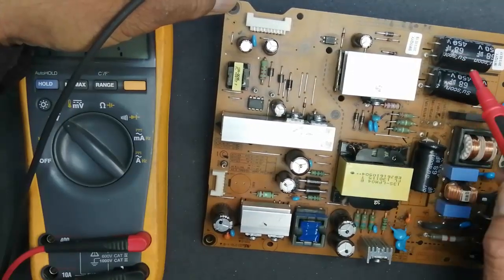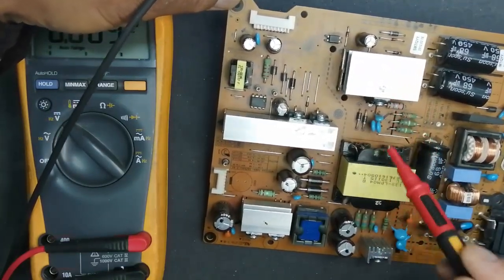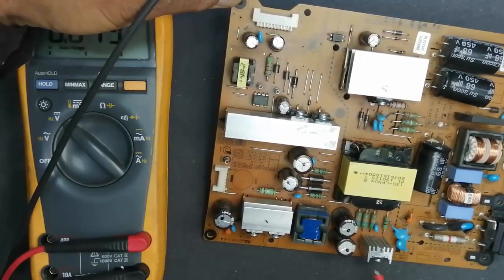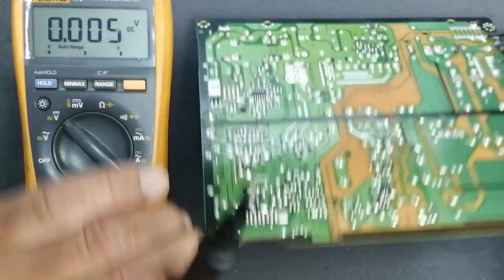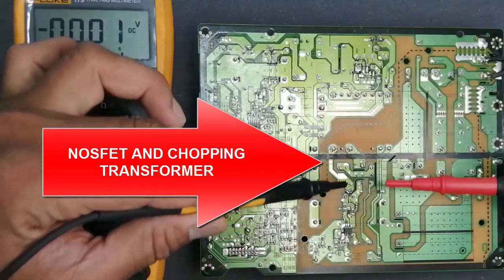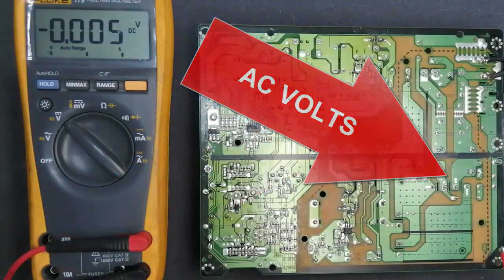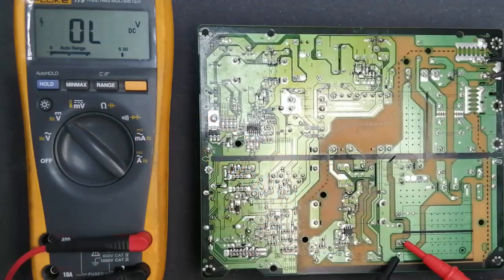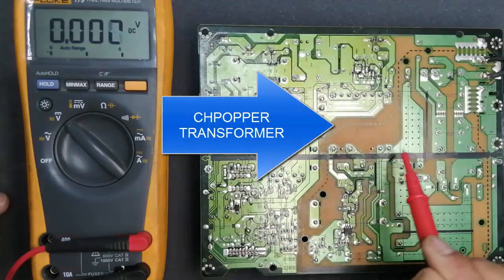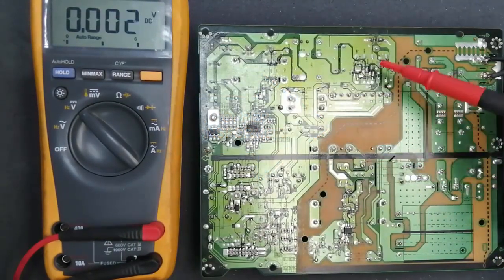Near the chopper circuit: we started at the bridge, after the bridge are capacitors, after the capacitor is the FET — MOSFET — and the small IC that drives this FET, and after the FET there is the chopper circuit and output rectifier. We will see here — this area is the chopper circuit. We moved like this up till here: AC, and after AC we shifted to DC voltage.